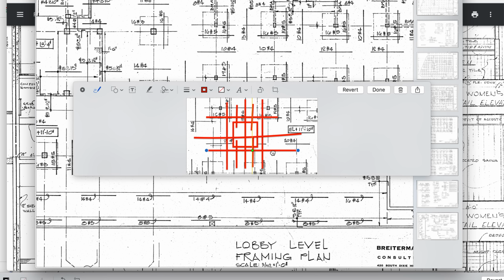So I'm going to double my column, come out to there, and I'm going to move that one up. So they're near the end of the rabbit ears. Rabbit ears being only probably 14-inch turnout, so that would only be about 2 inches. Well, no, 6 inch on center, so 6, 12. Yep. So about 14-inch turnout from where they were located, about 2 inches in. So that's 16 inches. So 16 inches approximately. So 16 inches, maybe 4 inches in. So somewhere about there.